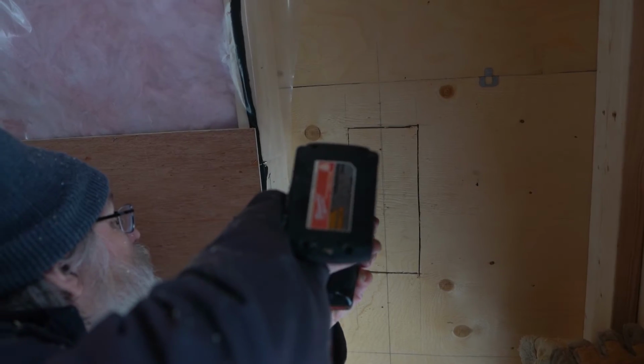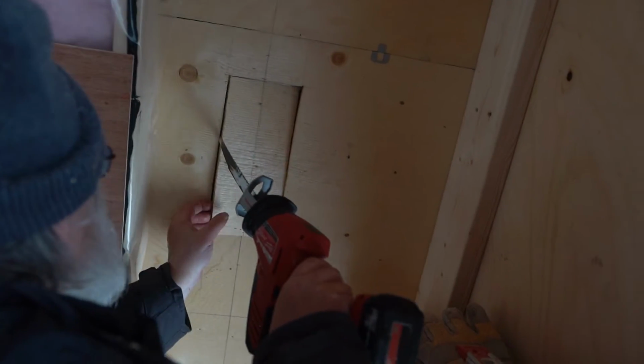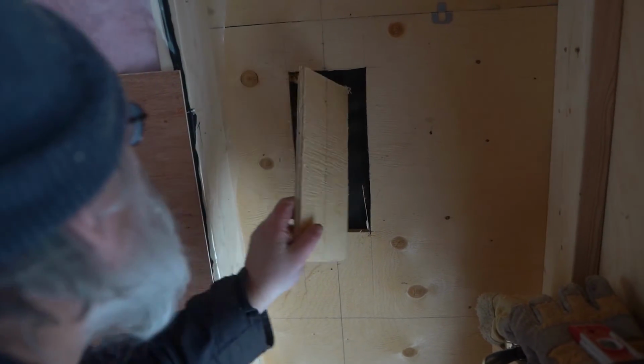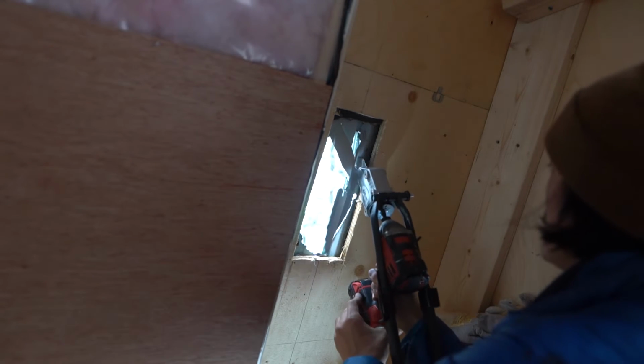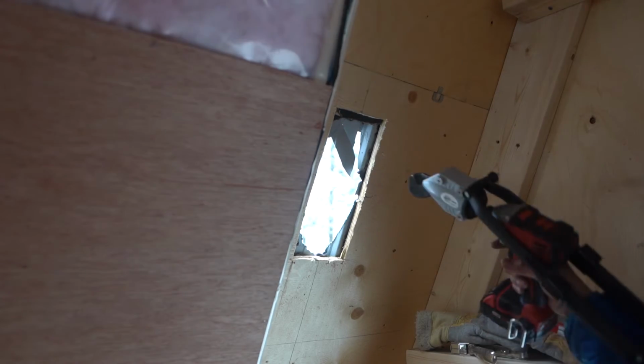After marking out where the pipes would go on the roof and stuff, we would essentially cut out the hole in the roof. We would do that with some metal shears that would connect to the impact driver that Rich had. And we would also, of course, use a drill and just kind of drill through the roof until we were able to fit the metal shears. And then we were able to cut our section there for our pipe to go through.